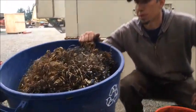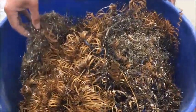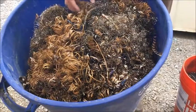This is another sample we're going to run — these are some larger turnings, this is all mild steel and stainless, and it's all ratty nested together. So we're going to try and put that stuff down the hammer mill as well, see if we can break it up enough to separate the ferrous and non-ferrous, and we'll see what we get.